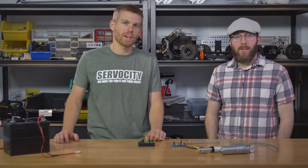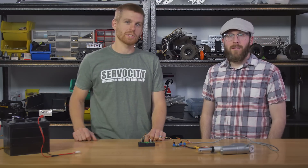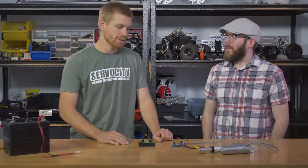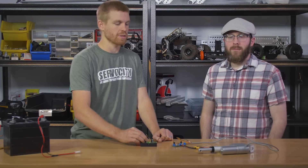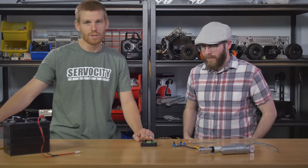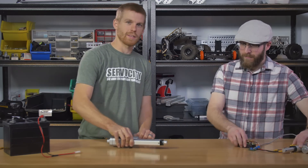Jason has talked to you about the motor controller connected to the linear actuator and the different options it gives you. To recap: you have speed control and position control. With speed control, the knob position determines how fast the actuator moves. With position control, the knob position determines the position of the shaft on the linear actuator. That's not too complex, but I try to go simple on my projects, so I want to talk to you about the linear servo instead of the linear actuator.